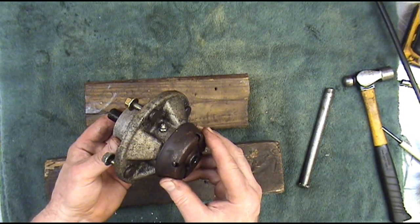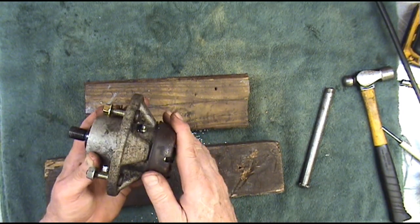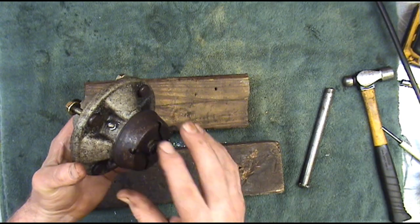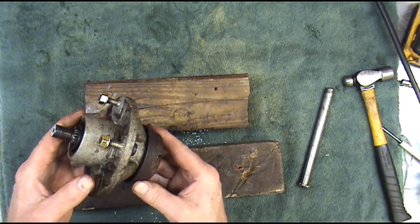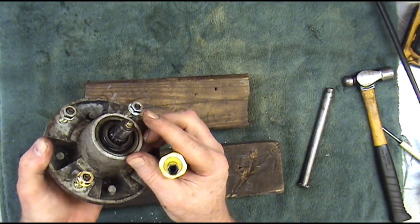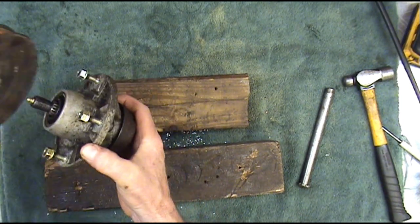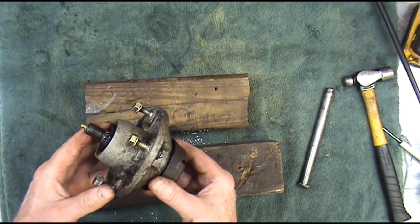This spindle will definitely last longer and give more years of service if you can grease the bearing. So now we have a rebuilt spindle with a grease zert that actually works — the grease will get to these bearings and make this last longer. Grease the spindle two or three times a year and keep plenty of grease in it. You can pre-pack it with grease before assembly. I'll put links below where you can purchase the bearings, grease zerts, drill bit, and tap. After reassembly, be sure to put the original grease zert back in the top of the shaft — even though it's not doing much, you don't want water and dirt getting down in there. Then sit the spindle back under your mower, put the screws down, and bolt your pulley on. I hope this video helps you and saves you some money. Thank you for watching, and stay tuned for more repair videos.